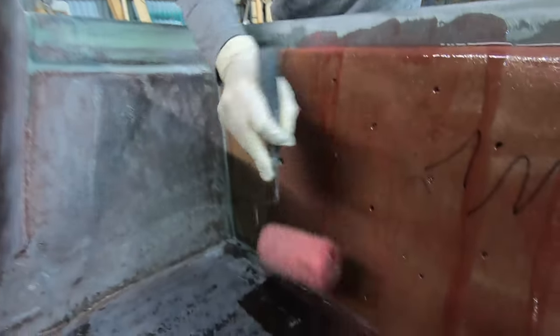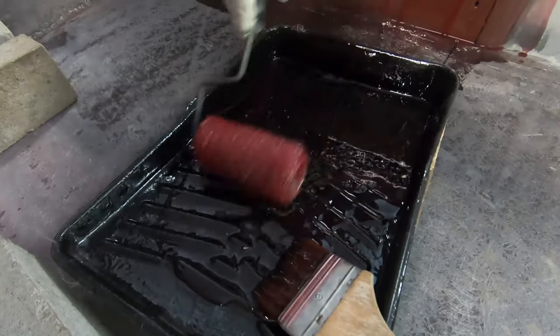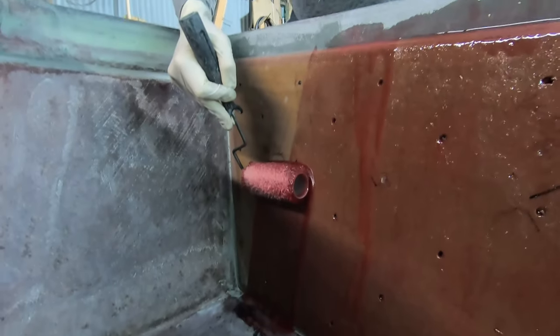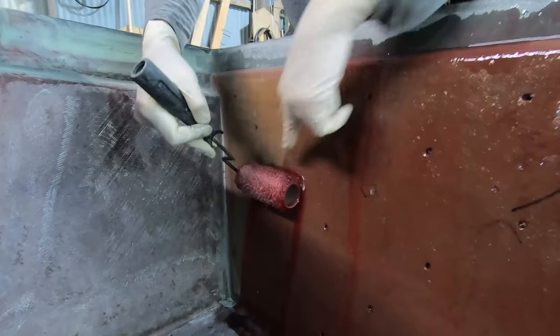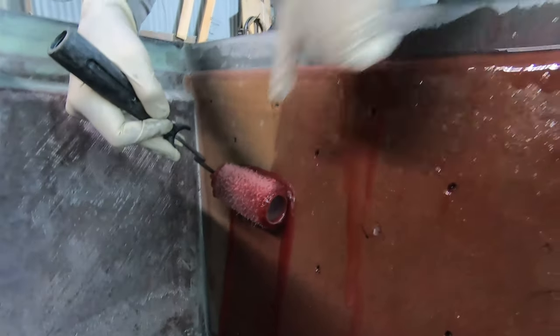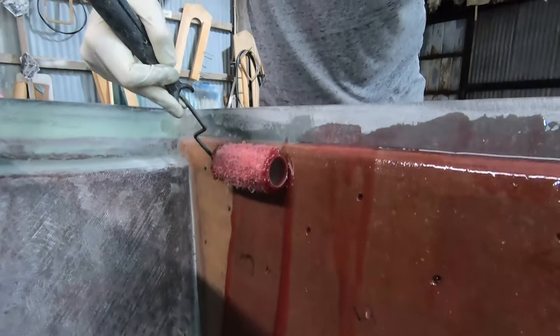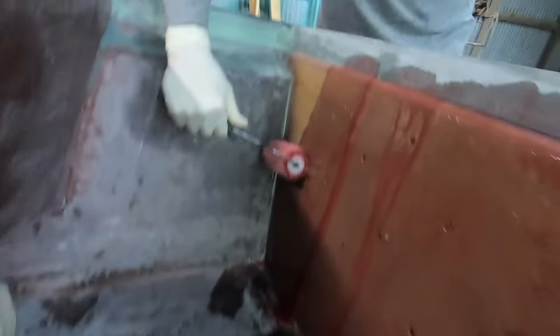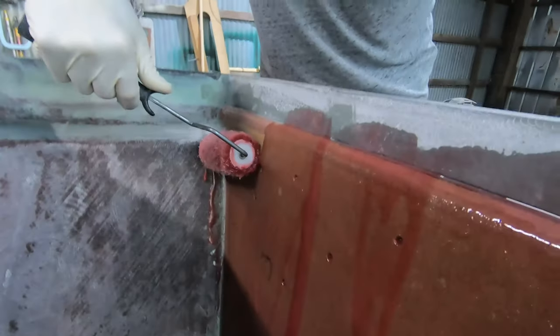It's an important step. Again, I'm gonna go back, you always want to resin coat any kind of core material prior to lamination. You can see, zoom in there, Logan. Show them that big O on top. You can see there's that big O ridge of resin, and we'll come back and clean that up a little bit once it's all on there.